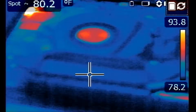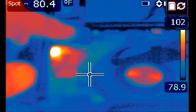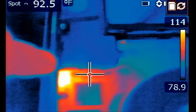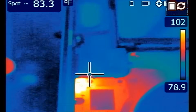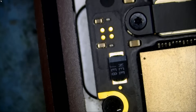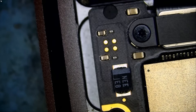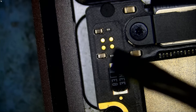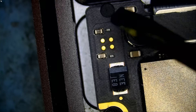Wait a minute — we have something hot right here. Or it could be the back of the board. We have something hot right here. Wow, we got it! Let me check and see what's going on here. Unplug the cable — battery is already unplugged — and let's check and see what we have here. Heat could be coming from any one of those caps, if in fact heat is coming from this side of the board.